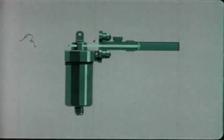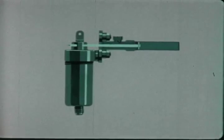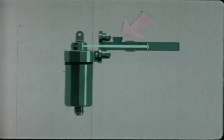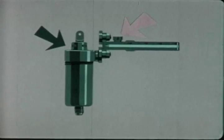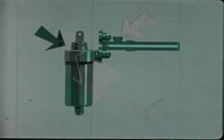Now, the exactor is not a ballistic charge. It is essentially a safety locking pin. Gas pressure from the M3 initiator enters through this inlet and pushes the exactor piston back. This removes the safety pin from another M3 initiator, and the seat ejection system is armed.